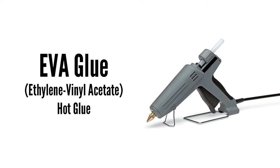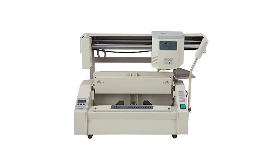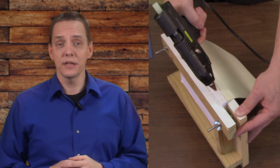EVA — ethylene vinyl acetate — better known as hot glue. I've experimented with hot glues but wasn't really happy with my early results. EVA is the primary glue used by professional binderies and also the glue used in pretty much every short-run perfect binding machine I've seen for sale. Hot glues can be harder to work with because of their fast drying times. Early on I spent a lot of time trying to get smooth even glue coverage, often resorting to using an iron to remelt the glue on the book spines — and that's because I used a low temperature gun. You need a heavy duty high-flow high-temperature glue gun and a putty knife or something similar to get a smooth spine. You also need a sturdy jig to hold your book with the spine up while you're working. I demonstrated this technique in another video — click the link in the top corner to watch that tutorial.